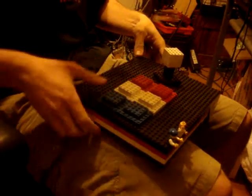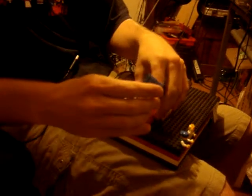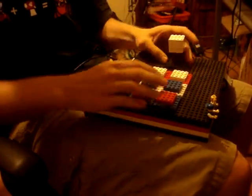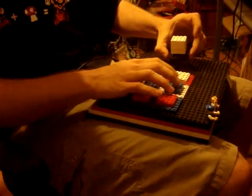But yeah, it just uses a DS flash card, and I put the program, after I compile it, onto one of those mini SD cards, which goes in a flash card that goes into the DS. Yeah, I made this project in 2 days. It's a fully functioning Lego stick with a swappable button. It's got micro switches and a Sanwa button. And I made it work for the PS3, even though it's using an Xbox board. It's got a JLF, so it's all Sanwa parts. Just Legos on it, the dust cover.